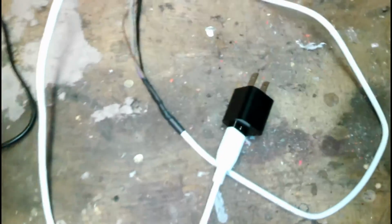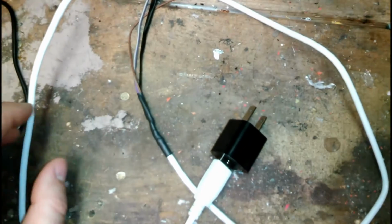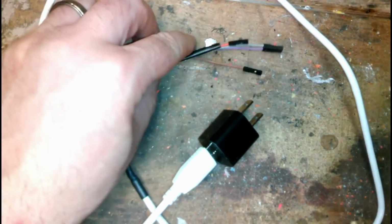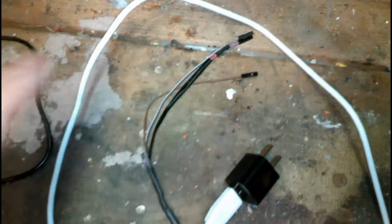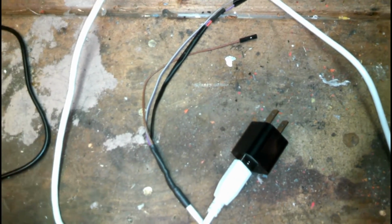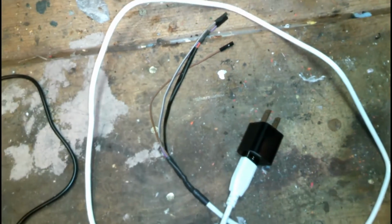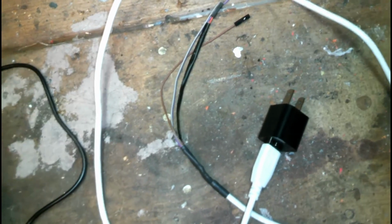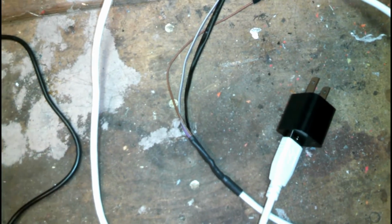Nothing. As I've researched online, I found out other people have had similar issues with this relay drawing too much power from the Arduino, and they've been having reset problems, not necessarily in this particular project, but in just various Arduino projects altogether. This particular relay board draws 200 milliamps per relay. So when all 4 are on, that's 800 milliamps. So that only gives me 200 left over to drive the Arduino.